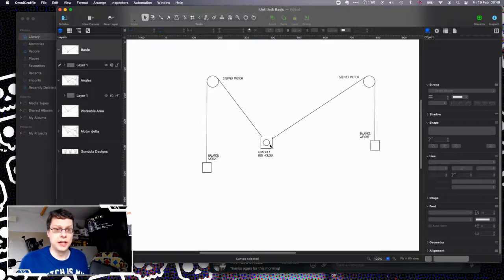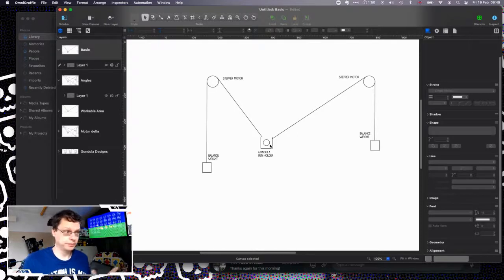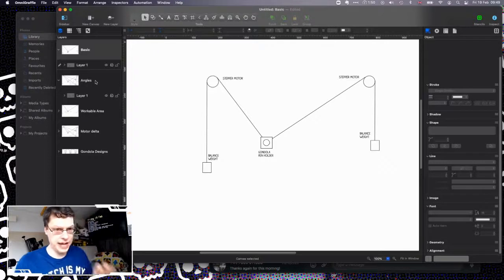The gondola may have a third motor, a servo, or even a solenoid to pull the pen away from the paper so you can do an unattended drawing. My build is currently in the prototype stage, but it's important to think through whether it's going to be manual, or a single continuous path — there are various algorithms that help with that. You can actually get some really cool results without a pen-up/pen-down mechanism.